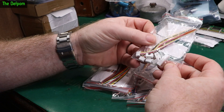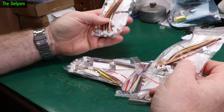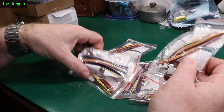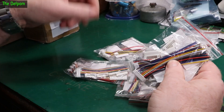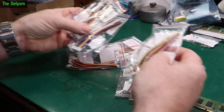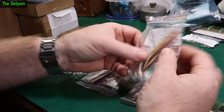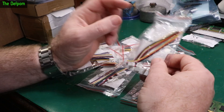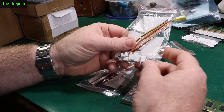Connectors and cables — pre-made JST connectors. There are different types of JST connectors with different name conventions depending on the pin spacings. These are an assortment of different pin configurations — different numbers of pins. And I think these are two millimeters. Look at the link down below to find out. These aren't the 0.1 inch spacing which is really common — these are smaller.